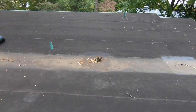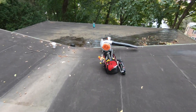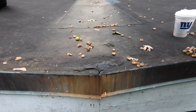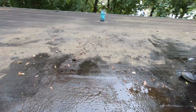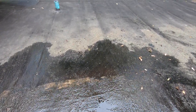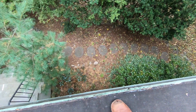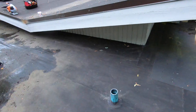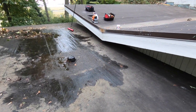Water sits there — you can see the white. What I'm going to do is lower this edge so water can run off here, and then instead of a drain I'm going to install a channel right here that will spill over this roof right there. The plan is to have a channel so the debris can wash off as the water comes.